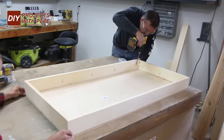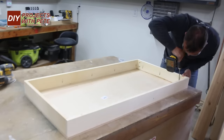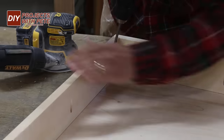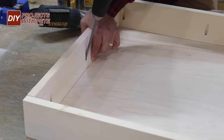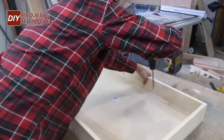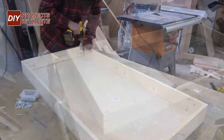Then use one and a quarter inch long screws to connect the frame. Double check that it's snug against the plywood and if there's a slight gap simply back the screw out a little and then put it back in. Double check that the screw does not go all the way through the plywood. You'll need to use the settings I recommended earlier or experiment a bit with some scrap wood to get the best settings for your situation and jig.